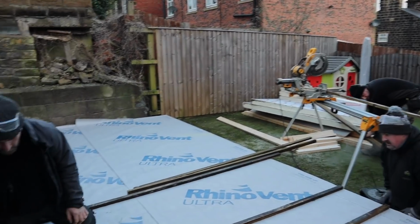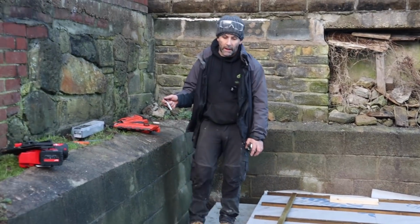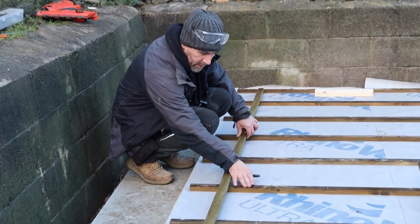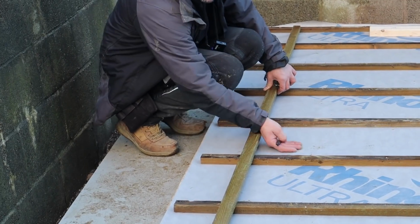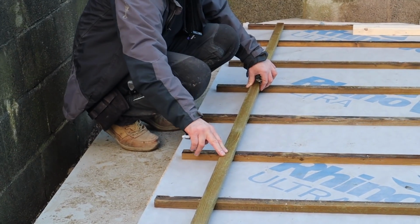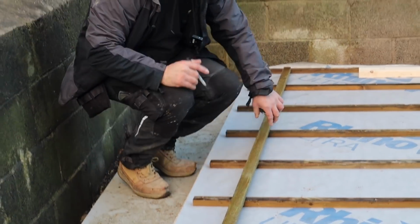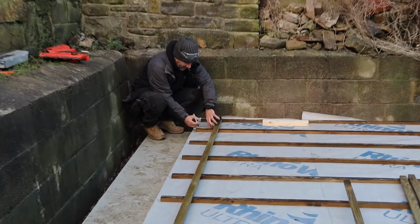Right, so we're going to double batten this. It's not particularly important on this one because we're putting a metal clad on the back, but if it's a timber frame, then what you want is a timber clad rather. So let's say your cladding goes that way, so the air can flow up there, but it can also cross flow as well. So when your cladding gets wet, it naturally dries out because you've got airflow, which will go that way and then that way. If you don't do it that way, let's imagine that these aren't there and you've just got horizontal battens, then your air's trapped there because you've got cladding there and your air can't go anywhere. This allows it to go under and across and under and across and all the way, so you've got full airflow behind. So what we're going to do, we are going to measure 6 inches up